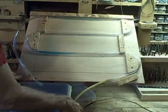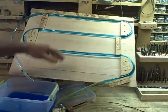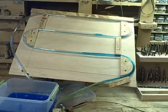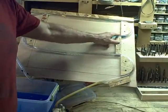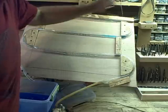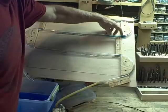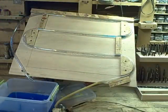If we tilt this on a weird angle and repeat this experiment, of course we're going to expect some of the water to collect on the sides. I'll turn the pump off and let's see what happens. Most of the water is still draining back even though the collector hasn't been installed very well. Now there's a little pocket of water forming up here, but even this water I don't expect would be a problem — it's not filling the tube completely, and even if it is, it'll expand in a longitudinal fashion. The conclusion is that the serpentine drain-back system is viable.